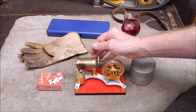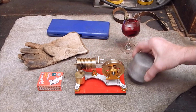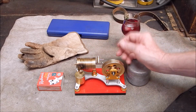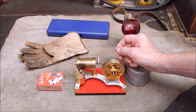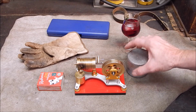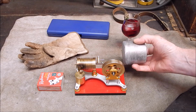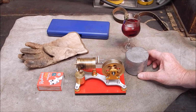and we'll try and get some of this heat out of the unit, because the whole thing is just getting red hot. In fact, everything's getting red hot, even the aluminium down here, the heat's just going through everything. So yeah, that's the plan. Make up a heat sink and put it on there. I originally thought about using computer heat sinks like I've done before, but they wouldn't look too good and they wouldn't fit very well, and trying to machine it with all those tiny little fins, they'd probably all just tear around and bend all over the place. So I'm going to have to start from scratch and make up something to go over this. That might do it. I mean, that might be all it needs. But once again, this is where you do your own home cast aluminium. Just melt it down. In this case, I just poured it into an old fruit tin, you know, dessert tin. And from there, I'll just machine it down, and at the end of the day, it'll look plenty good enough to do the job.